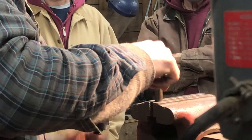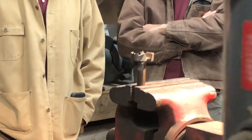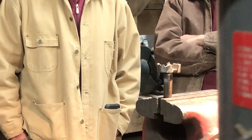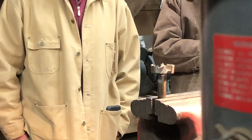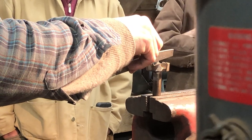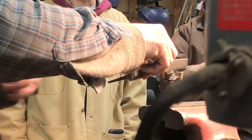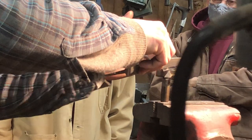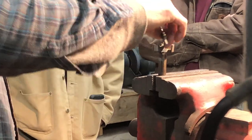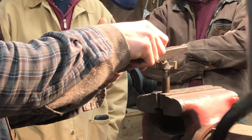So with these sides, just as you're sharpening drill bits, and again, also with bung cutters, if you can try and envision in your head how that drill bit is cutting. If I were to file this tooth so that it was at 90 degrees to the center line of the bit. So let's say I'm right there, and we're imagining this is the center line. It's perfectly, what's the geometric term, Matt? Radial.